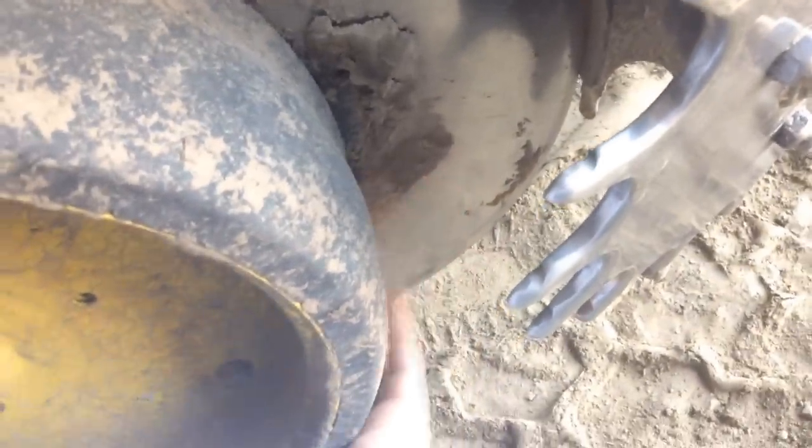Next we have our seed boxes, which we just explained how to convert. We have seed extenders on here from Diesel Grain Systems Incorporated. These are all driven by chain. We have our no-till row cleaners right here, and we have our opener. This wheel maintains the depth so the disc can only travel so far down into the ground — it just keeps it from going too deep.